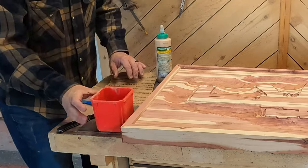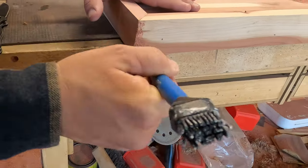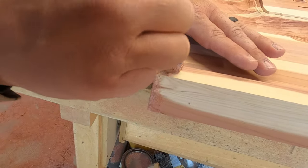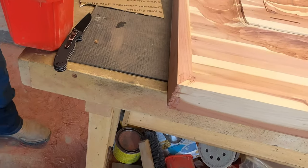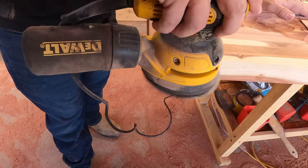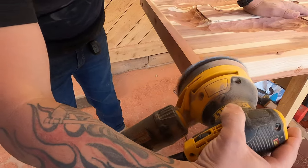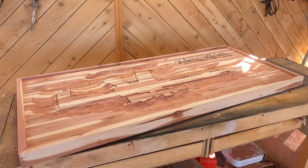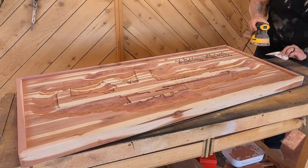Good old glue and sawdust. This sawdust came from all of the sawdust we had on the floor, so we wanted to make sure it was sifted pretty good — that way we had fine dust in there to fill the gaps, and this worked really, really well. It's not perfect, but nothing I make ever is. I filled the gaps in the miters and also filled the nail holes on the edge of the board, then used the random orbital to sand it off and get all of the sharp edges off. I had rounded miters, rounded corners on the frame itself — I wanted it to have a super finished look, so I really took a lot of time with the random orbital, then went back with hand sandpaper and made sure everything was exactly the way I wanted.